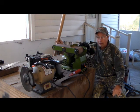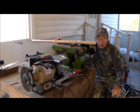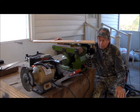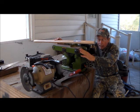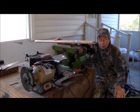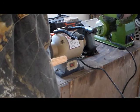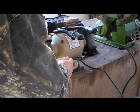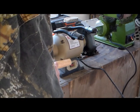I could not find in my small rural Georgia town an exact replacement. So what we have done is we have here a handle for a shovel, which is about the right length that I wanted, and also about the right diameter, once I actually trimmed off the end, which I've already done. We're going to grind this down to fit with my grinder over there, do a little fine finishing on the sander here, drill a couple of holes, and then return my good and faithful tool to service. I'm going to reduce the diameter all the way back to approximately this diameter — this part is nearly right, but this is much too thick.